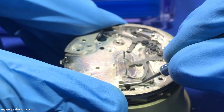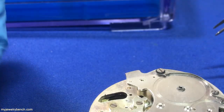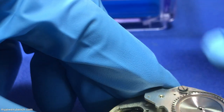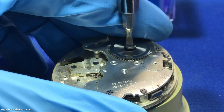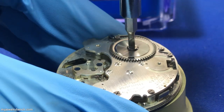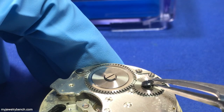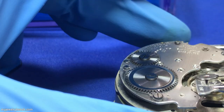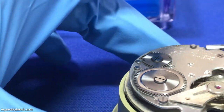Here you can see I'm just manually testing the stopwatch to see if the articulated gears all work correctly. The hack was actually moving back and forth — that's the gear hack, not the balance hack. I'm putting on the ratchet wheel for the mainspring barrel — this is a regular right-hand thread. The main ratchet here for the crown is a reverse thread, so I'm going to back it off, make sure it's threaded correctly, and then tighten it up. Do not over-tighten these, and when taking them apart, assume that gear has a reverse thread screw — just do it very gently.